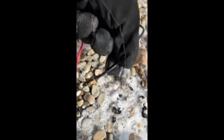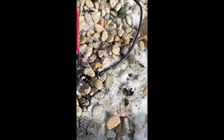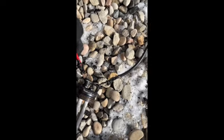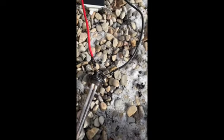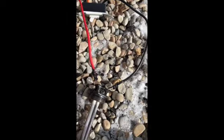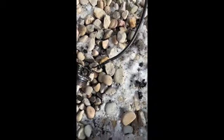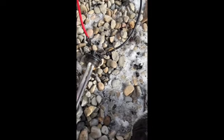The insulation wiring, yeah, it didn't hold out either. So clearly, I think this is 75-degree wire, maybe for internal wire temperature. But the insulation on the outside maybe is 115 or something. But it was holding out against 200-some degrees. It was going to fail over time and just continually expose my wires more and more. Thus, eventually the wires could get moved, shifted, touched, whatever.